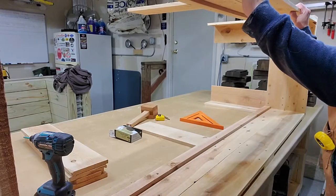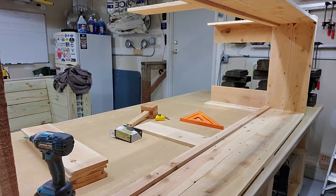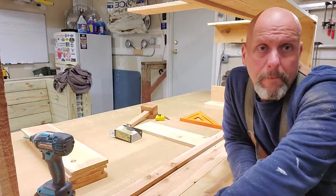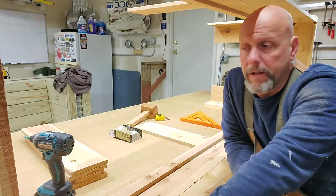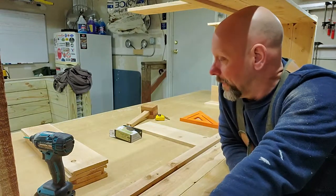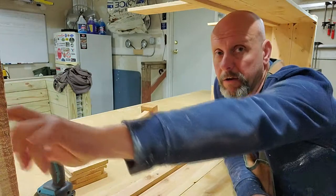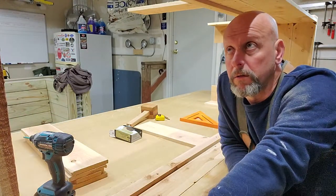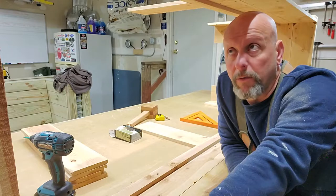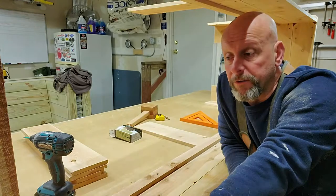Alright, with that all assembled, here's your frame. Now what we do — the fun part. I believe 13 boards will fill this space here, so I'm going to get my 13 boards including that one that's all split, because that's going to go on the side where there's a little more support. That split in the wood is more cosmetic than anything, because where I'm going to screw it there's no split — it's just on the very edge. If you sit here and nitpick all your material with something like this, it's going to make you crazy.